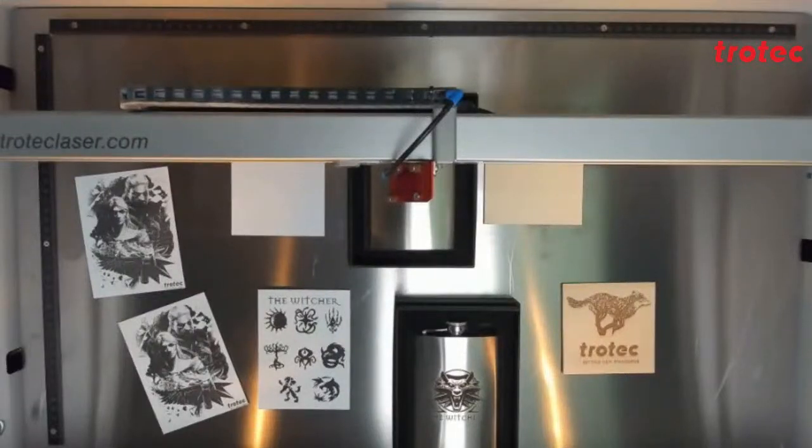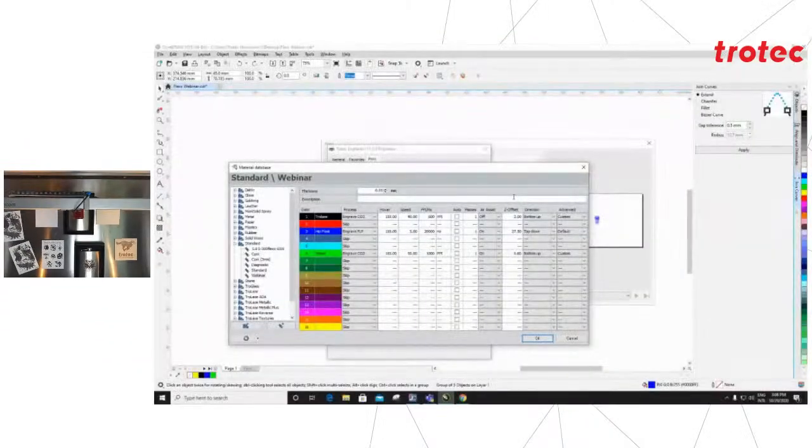Each material that you will see over here, I have programmed with that individual material's settings, as well as the Z offset I have calculated beforehand. This is the focal height difference between the different products. Using the Z offset, the machine will automatically adjust its focal point to match our measured distance.